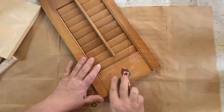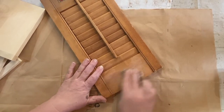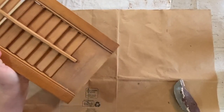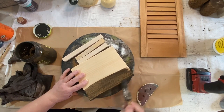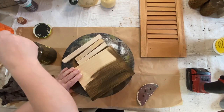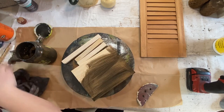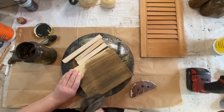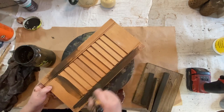If I have any rough spots, the stain doesn't wipe off very easily — it just sticks really hard. It had a few little stickers or embellishments on the back of the shutter, so I just sanded those off. Now I'm going to take my dark stain — this is antique wax and water and a little touch of black paint — and I'm going to stain all the pieces, including the shutter. I want everything to be a cohesive color because I am going to be putting another color over the top, just a dry brush, so I wanted the color that comes through to all be the same.